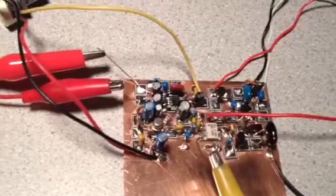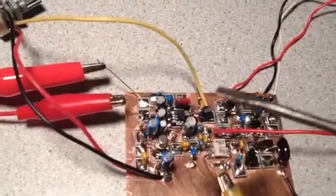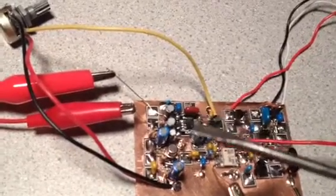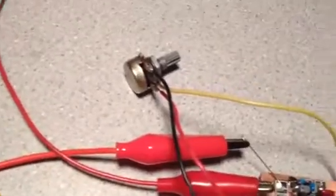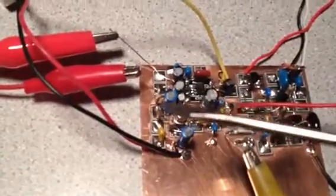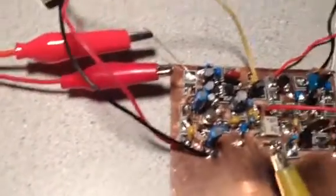But due to the lower output of the ADE-1 mixer, a ham friend of mine, NT7S Jason, designed this little preamp for me here. It's a common base audio frequency amplifier, and that picked up the input to where I just have lots and lots of audio now.